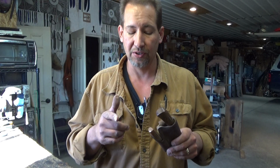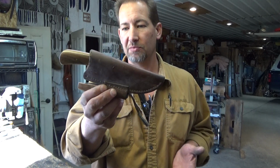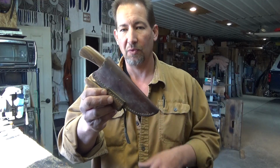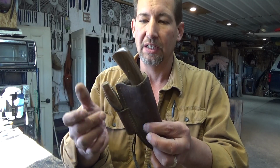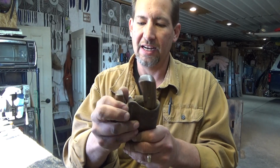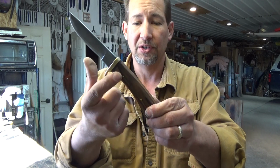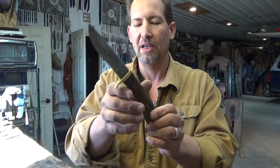Now, one example of stuff that 52-100 will do. This is one of my personal hunters. This was my hunter for like 5 or 6 years, something like that. And it's made out of the 1-inch McMaster-Carr 52-100. We got a clean leather style pouch sheath, with the little cutout, and it's got the 3 rivets holding the belt loop in the back. This one right here has a matching ferro rod used for fire starting. It's got a Bolivian rosewood handle, back when I was doing 2 brass pins, brass guard and red and black linen micarta spacer.